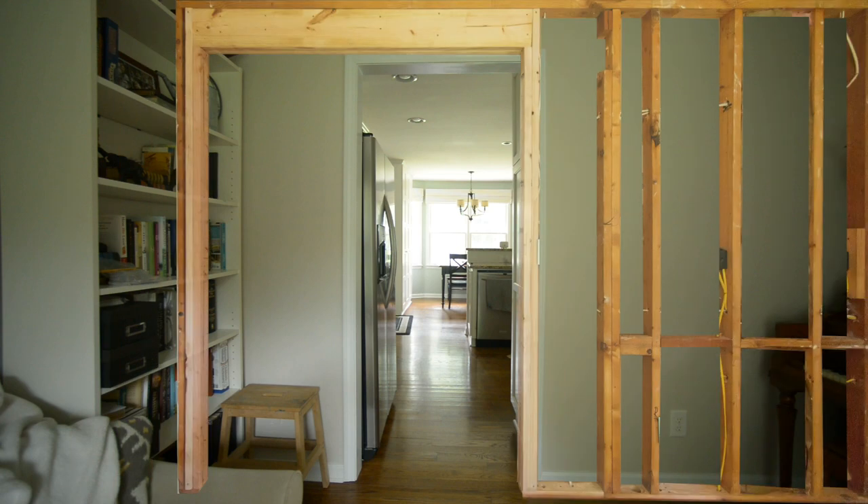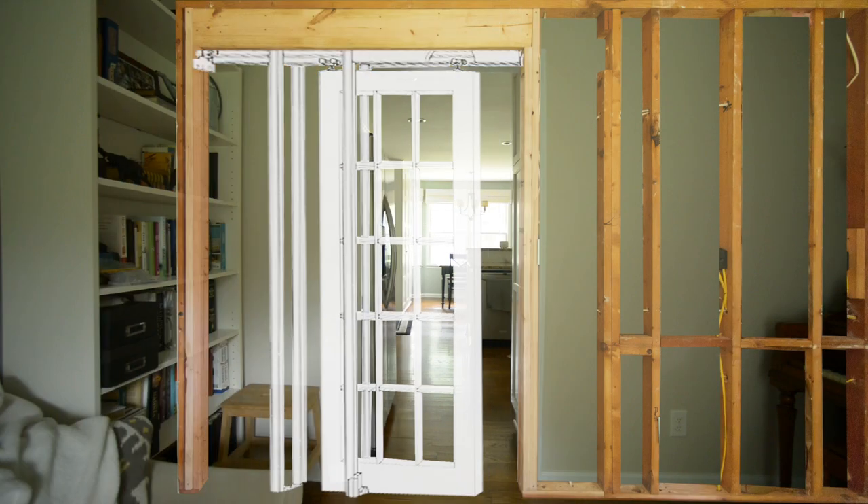So here is what I'm going to do on this wall, and this video will cover this portion. I'm going to be installing a pocket door on this wall. It is a load bearing wall, so I'm going to have to install a header here. So this is what this part will look like.